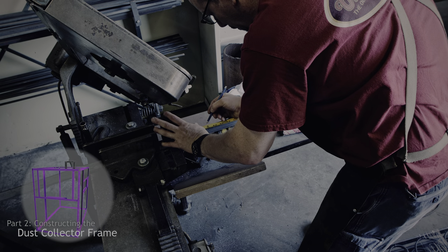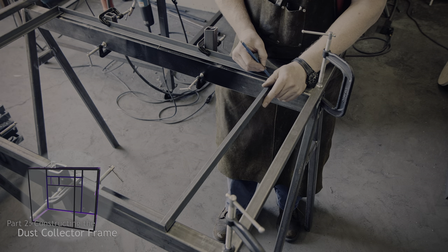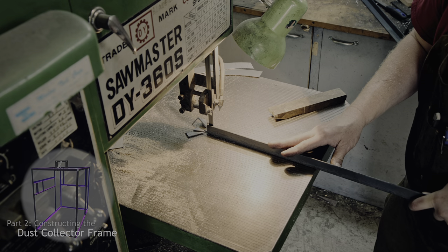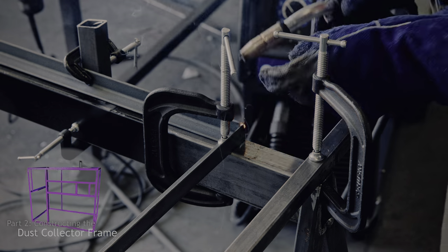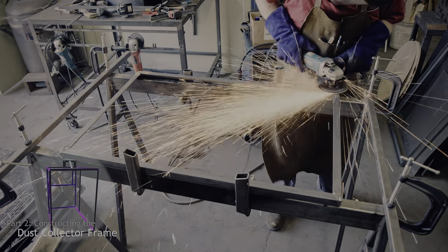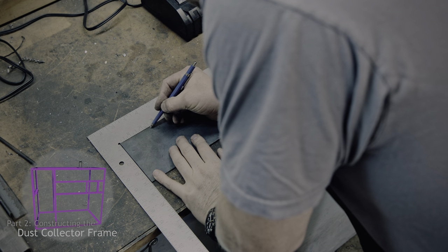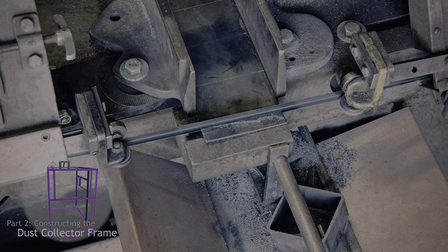As the frame will stick out of the metal dust collector, I am giving it a coat of spray paint to make it look better. Now I have to figure out the overall frame of the Frankenstein machine. I want it to be on rollers and essentially clad in sheet metal held together by angle iron. Once I have tack welded the four pieces of angle iron in place, I can do a proper weld from the other side. There will be two of these frames, one for the bottom with rollers and the other one for the top where the blower will be suspended. To attach the four rollers, I will need to make some plates to which each roller can be screwed. Fortunately, there is a cut-off just perfect for the job but that needs to be straightened a little bit first.